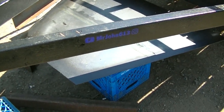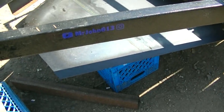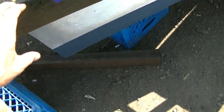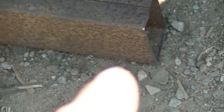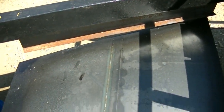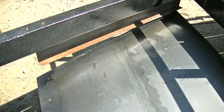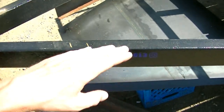It's a little bit windy out right now, but this is what I'm doing. I got the sheet metal cut out, cleaned up the sharp edges, and put some black undercoating around the edges. I figured four inches isn't a very deep toolbox, so I took one of the old sections I cut out of the frame and glued it underneath — so instead of four inches tall it'll be like eight inches tall. I split it down the middle so instead of a box channel I now have two C-channels. I put one of the C-channels in here and I'm going to put the other one over on this side, and then I'll have a deeper toolbox.